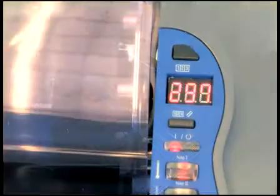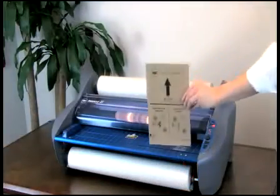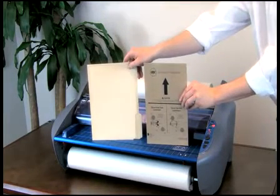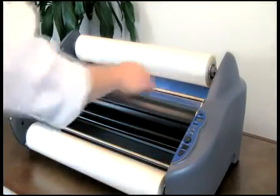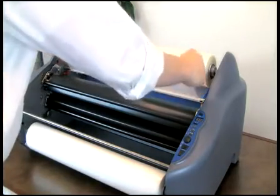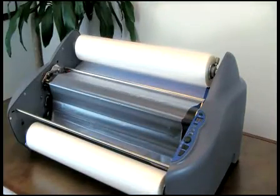This method also works best when the laminator is preheated. Look for the threading card that is enclosed inside the packaging. You can also use a manila folder or any letter-sized cardstock to substitute the threading card. Remove the feed table and the heat shield. Replace the bottom roll and the top roll following the same steps as described earlier. Unroll enough film from the top roll to tuck under the idler bar and drape over the heat shoe.